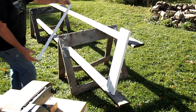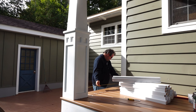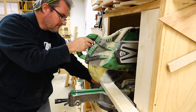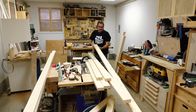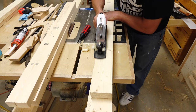I gave them a few days to dry before moving them out to the front where I made some careful measurements for the railings. I'm using new framing lumber for the railings — mostly two by fours that will span the top and bottom. I was very picky when I bought these but it's nearly impossible to avoid a small amount of twist. Luckily that's easy enough to fix by planing down the high spots before sending it through the planer to flatten it.